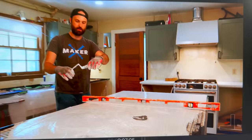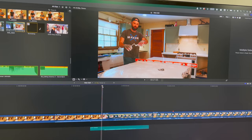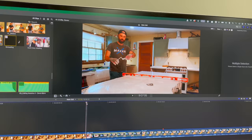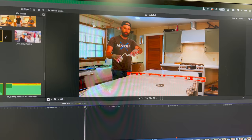Quick note from Anthony: we accidentally left Bob's mic on while he was outside mixing concrete, so that's why you can't hear clearly in this section. I am working on screeding the concrete out with a level, because it's long enough to go across the island. Next I'm tapping the edge of the forms with the handle of a trowel just to release any potential air pockets and help get a cleaner edge.